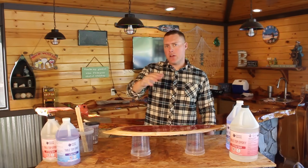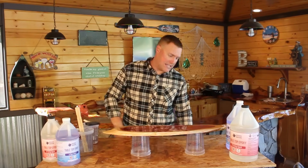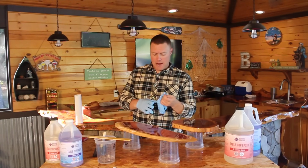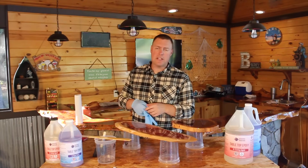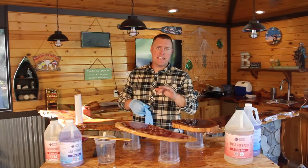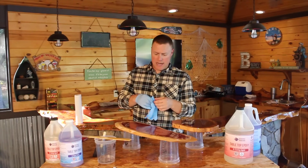After four hours, it's tacky enough and you can go ahead and pour that additional flood coat over the top and let it roll off the sides. So now that we've let this cure for four hours, we'll go ahead and pour the flood coat. I'm actually going to mix one batch of epoxy — it's been curing for four hours, it's tacky to the touch, so we're ready to pour a flood coat, and that's what we'll go ahead and do right now.